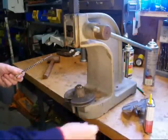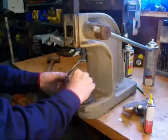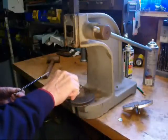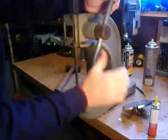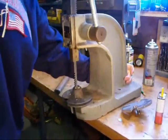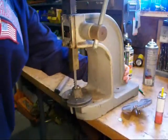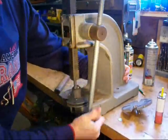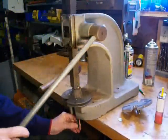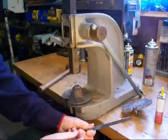For the second pass, we have to put that shim in there — the shim goes like that. I'm going to put just a little more oil. This is a bit of a struggle because the press is mounted to the table. Get ready to catch that broach — you could crack it if it fell on the floor. And out comes the broach with the chips on it.